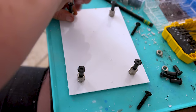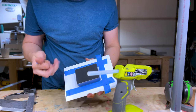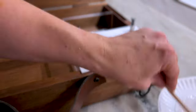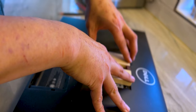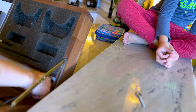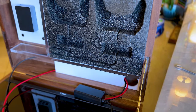I've added nuts to the posts to get the right height. For the insides I'm using all sorts of different adhesives: for the Pi I'm using hot glue because it's super easy to detach if I need to troubleshoot; for the screw posts I'm using two-part epoxy; the acrylic dividers are glued in with cyanoacrylate — aka super glue — and the monitor wood supports are glued in with two-part epoxy. I absolutely love utilizing the monitor's quick release plate — it allows the plate to be permanently bonded to the briefcase while the monitor can still be removed. I'm adding a little strip of purple heart that'll lay over the button and be accessible from the bottom of the monitor. I have Bubz on standby while I start adding wires — his hands are much smaller than mine. Basically my plan with the wires is to jam everything into the little white compartment, tape it down, and forget about it. With the wires complete, I can finally glue the monitor in, and lastly, under Mimi's constant observation, put in the controllers.